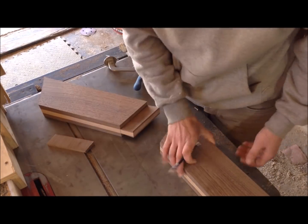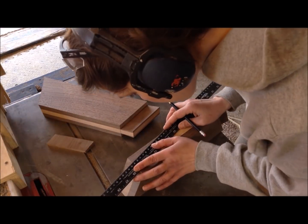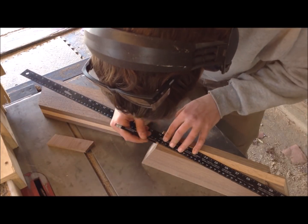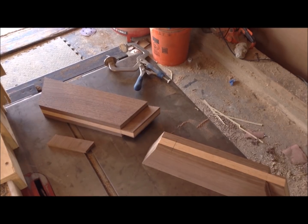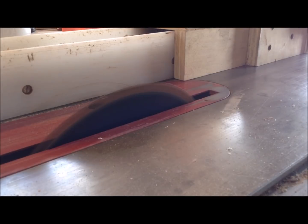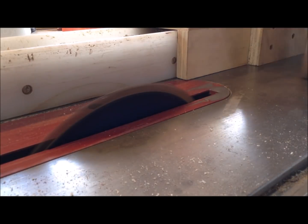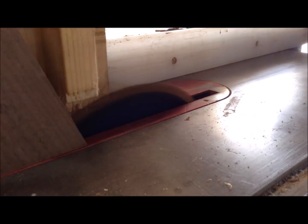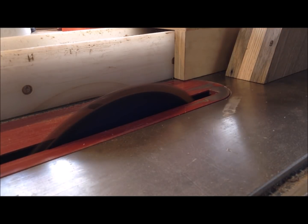They're made by cutting the tail, so I just use the tail as reference onto the other pieces of lumber. The tails are all on one side, and then I'll be cutting sockets on the other. So I transferred all of those measurements from the actual tail and lined everything up with my blade, which I haven't moved since I cut the tails, and I was able to then cut all of the sockets. Same way, measuring off one edge. If your measurements are correct and you flip these like I'm doing, it cuts it perfectly symmetrical.